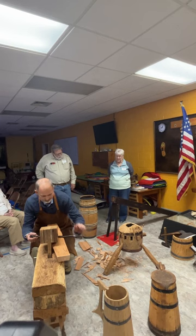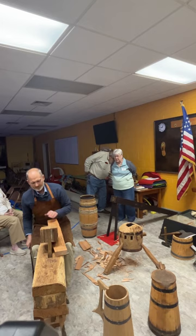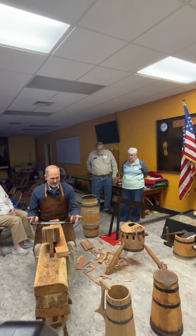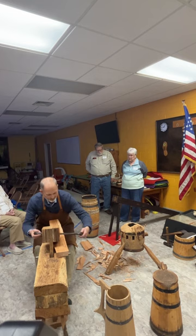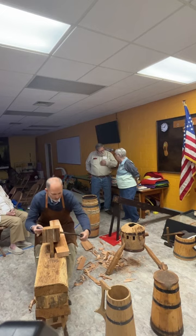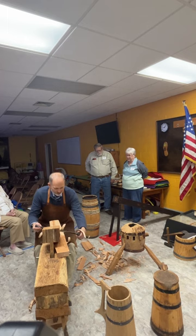The next tool is a draw bench. I'm sitting on a tool called a draw bench, which is basically just a foot-operated device that clamps a piece of wood in place when I put my foot on the pedal — freeing up both hands to use a draw knife. It's named so because you're drawing the knife towards yourself as you're shaping the material. Learning how to sharpen your knives is also part of the apprenticeship — for any woodworking trade, you're being taught how to sharpen your tools to achieve the cuts you need.